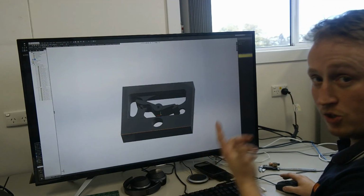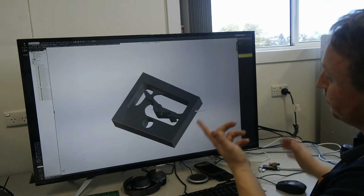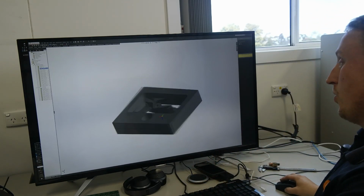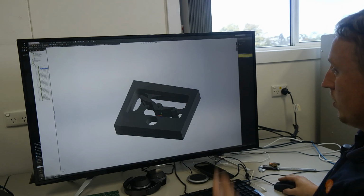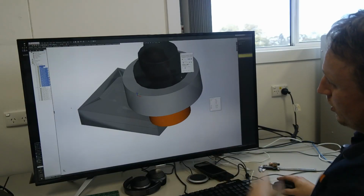As for the machining, I use SolidCam to define tool paths. A very handy feature of the program is it has a high-speed machining option called iMachining. It allows for very high-speed helical machining toolpath removal. Anyway, I won't go into it too much, I'll just do a preview of how the machining is going to occur. First off, we have a facing operation.